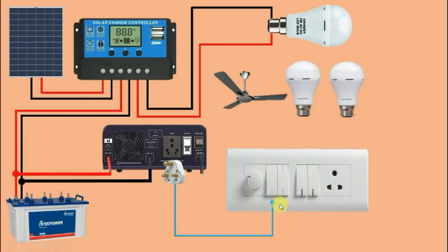Phase supply comes to the switchboard through the inverter. Remember, at the right-hand side pin of the plug top you get phase supply, so connect phase supply there. Now in this switchboard, I will use one switch to operate this fan. To also control the speed of the fan, I have placed a regulator here. Connect one wire from the output terminal of the switch to the regulator's input, and then from the output terminal of the regulator connect one wire and provide phase supply to the fan. For this socket, I am using another switch — connect wire from input to output terminal and to the socket's right-hand side pin to provide phase supply.